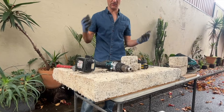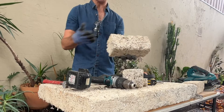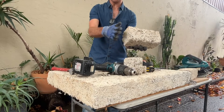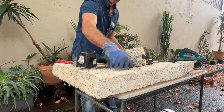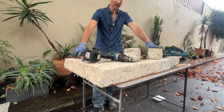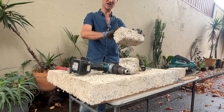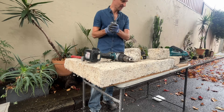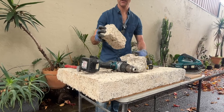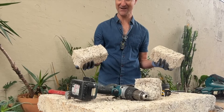I feel like that's a really good test of all the different ways we can work with hempcrete. If these were sort of bricks or blocks, we know we can cut and adjust them to suit our wall, go around a corner, and then bind them together with a lime-based mortar. Really easy stuff to work with — I'm super impressed. It's a little bit like a combination of wood and masonry, which makes sense because it's a fibrous, woody material with the lime. I've got my two samples for my talk at the school of architecture tomorrow at the University of Sydney. It's quite light — I'll hand those around for a bit of show and tell. Onwards and upwards for hempcrete!